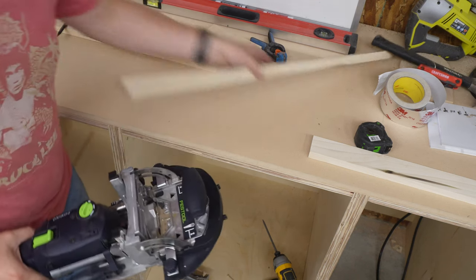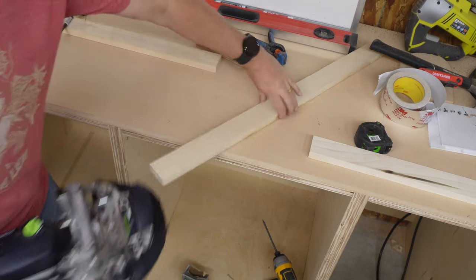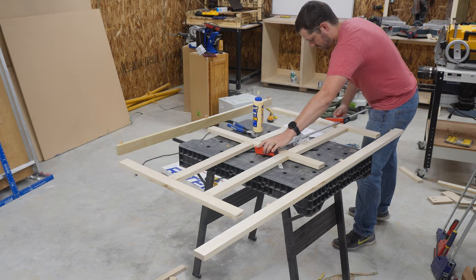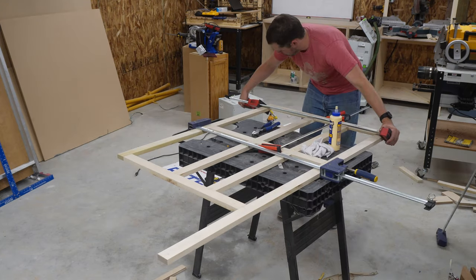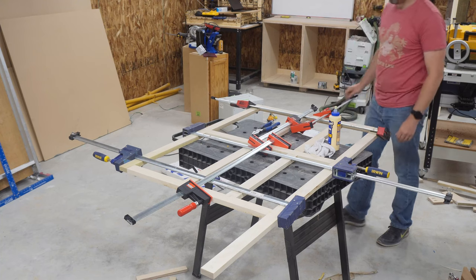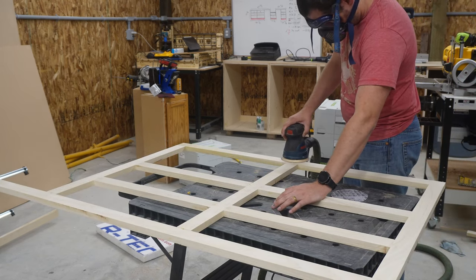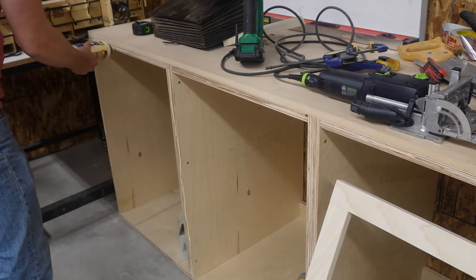The domino is by no means a required tool, but there are certain places where it just speeds up the process in a way I really appreciate. After a test fit making sure everything was coming together nicely, I put glue on all the joints, clamped it together, and let it sit for a couple hours to cure. If you don't have enough big long clamps, you can glue this up in a few sub-assemblies, which just means more waiting between each step. Or you can daisy-chain some clamps together into some sort of unholy abomination mega-clamp — I'm sure there are good reasons not to do that, but it worked. As usual before attaching the face frames, there's always the final step of sanding, which is never the fun part, but it really does make a huge difference, even in shop furniture.